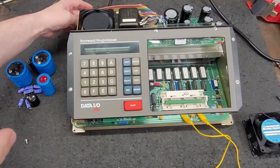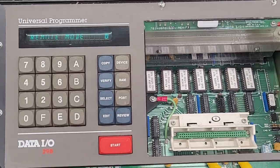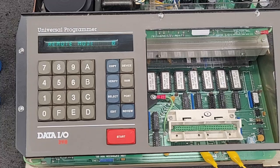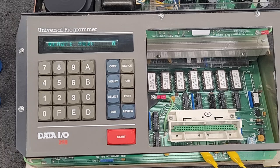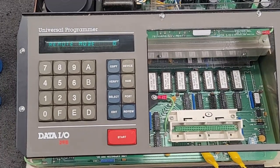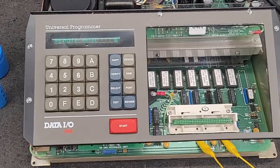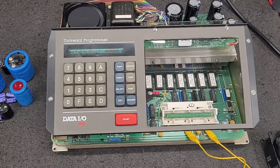No bang — that's a good sign. We have a self-test. It's 64k. I chose this one because it boots really quick compared to the 1 meg. But this will be 1 meg with the aftermarket memory module. And it's in remote mode. I think this 40-year service of this DataIO 29B was successful.